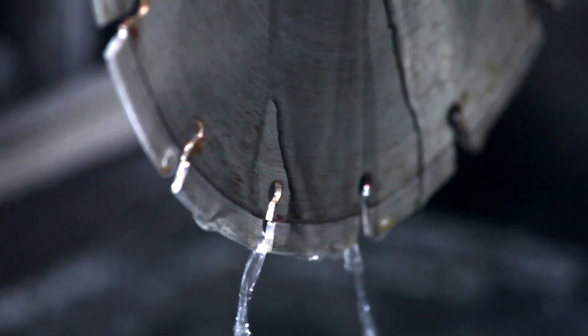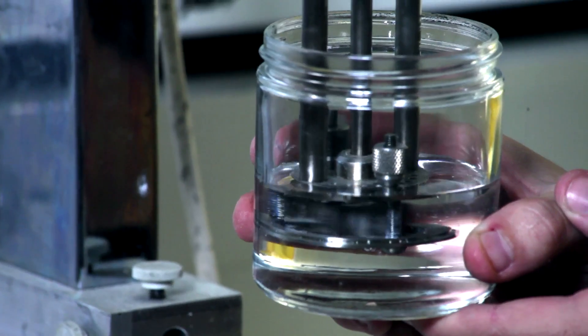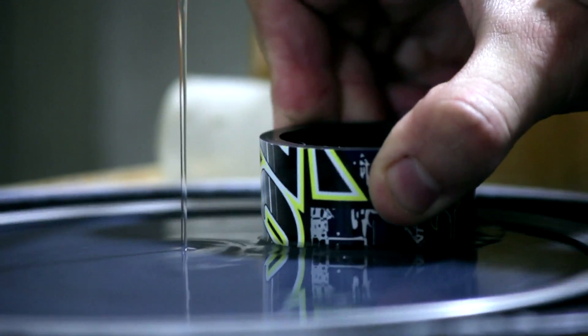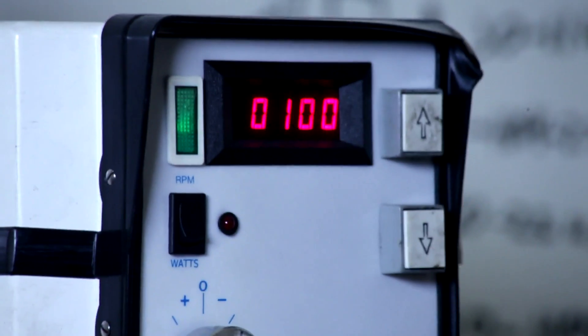To do this, we cut a bat into pieces and take those pieces into an oven. We carefully combine the resin with oxygen, blowing it out as smoke, leaving just the fibers. Then we can go in a microscope and pull those fibers apart and make sure that each layer is in its place.